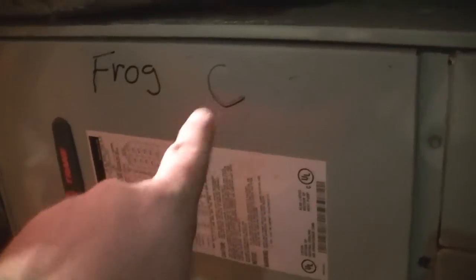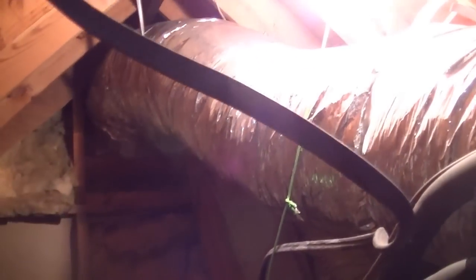Alright guys, this is our second unit. As you just heard, if you could hear that refrigerant in that line — it even appeared to have been going through defrost. This line was very hot. It's actually cold as if it wasn't air conditioning — it has shut off. In a few seconds it should start again in heat mode. Our unit here has gone back into heating. This is the hot gas line in heating mode — it'll be extremely hot, coming right off the compressor basically, and then you have a sub-cooled liquid line which will still be warm. There are some negatives here: it's directly panned to the unit, has a sharp turn, the duct is actually too small for the unit, and the return grille is too small as well. So it runs a little hot all the time, which is unfortunate.